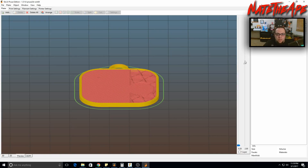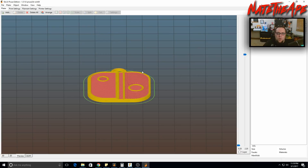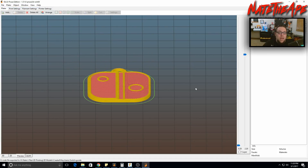Looking at the layers, where the yellow lines start in the middle is where we add the second color — that's at 2.2 millimeters. We're exporting with the 0.2 Normal settings in Prusa's slicer along with their Color Print option. We choose Color Print rather than the Z-hop option because Z-hop moves the nozzle up and down, which messes up the filament change. Export the g-code to the same folder as the STL, saving it as 'switch colored.'